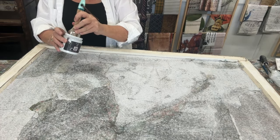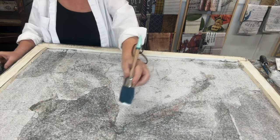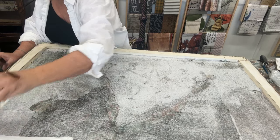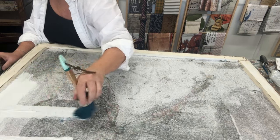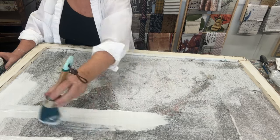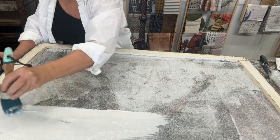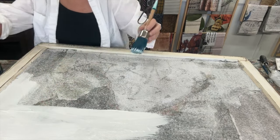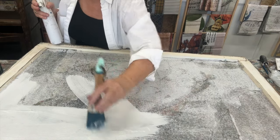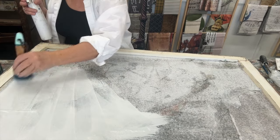For the back I want to paint the whole entire back with white, so I'm using DIY beadboard paint. That will make the decoupage paper on the other side pop a little bit more and give it some protection. Because DIY paint is clay-based, it's very thick and pigmented, so you can water it down a little bit with a spray bottle to make it go further — you really don't need it as thick as it comes out of the can.